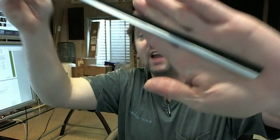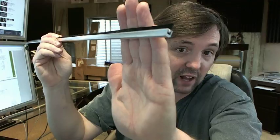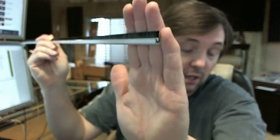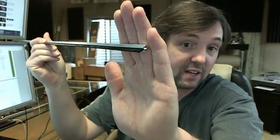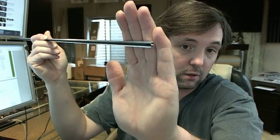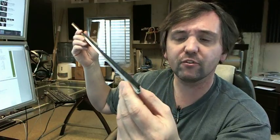The NB means that this is a nylon brush — a stiff nylon bristle. Pemko also has this available in the 5025ASB soft brush, which would be like a pile, very soft. I would use the NB on doors other than wood, such as aluminum. I might consider the ASB soft brush if it's a wood door.